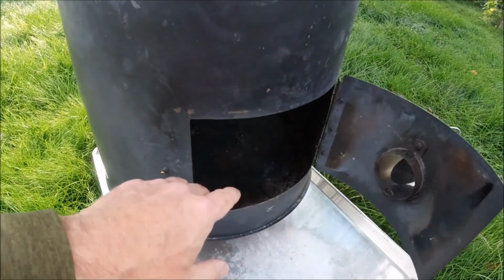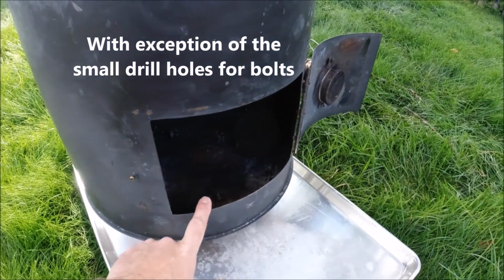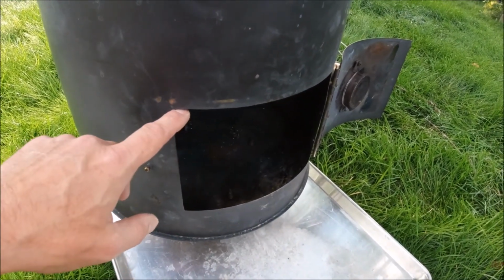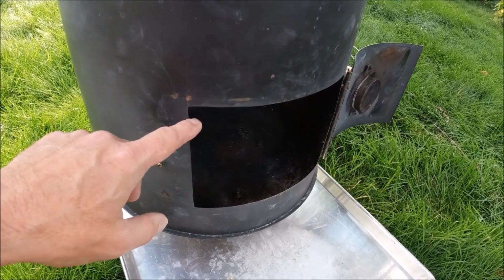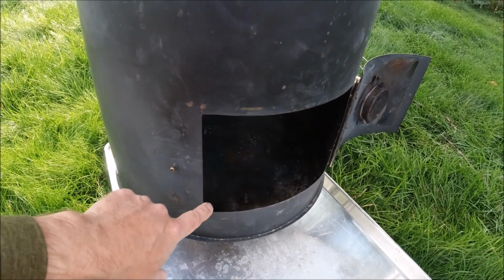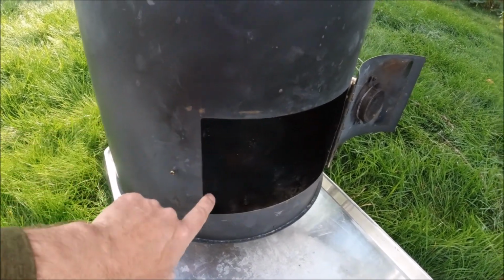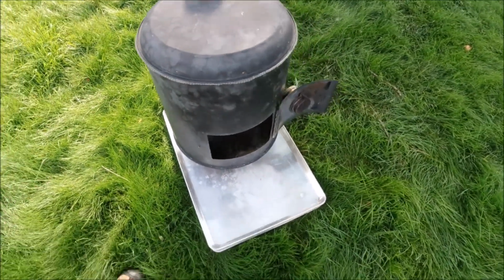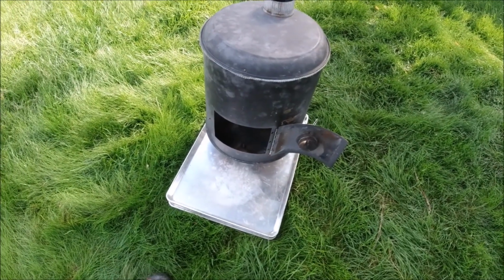And all of our holes here, this is cut with a Dremel tool. It's very difficult to cut stainless steel with a handsaw of any type, so I just bought like 100 cheap discs for the Dremel tool, it's $12 or something for 100. It's just diamond wheel cutting discs, and cut that out. And all of my circular holes are cut with the Dremel tool as well, and then just cleaned up with a file or a bit of sanding.